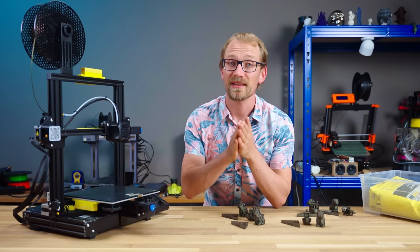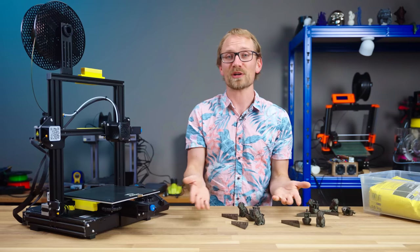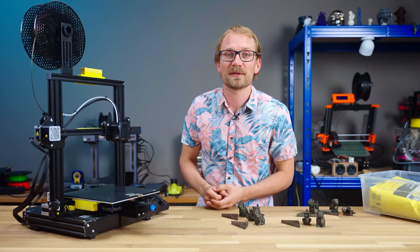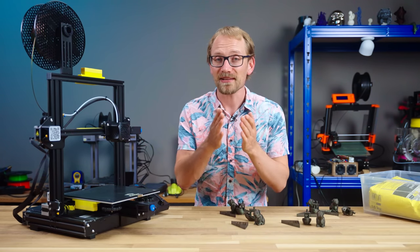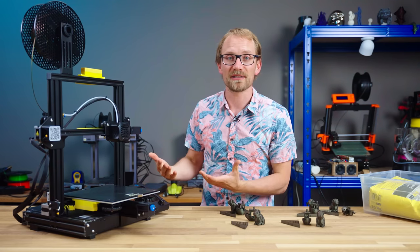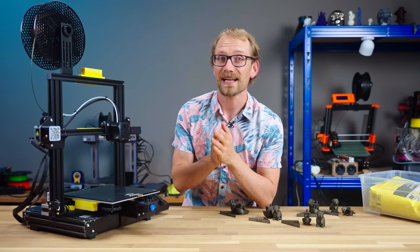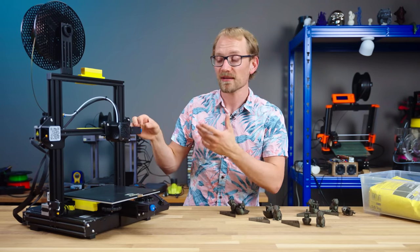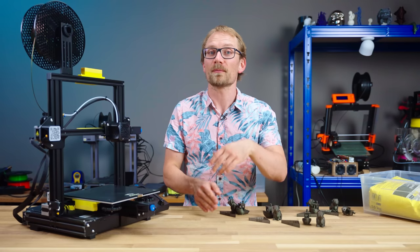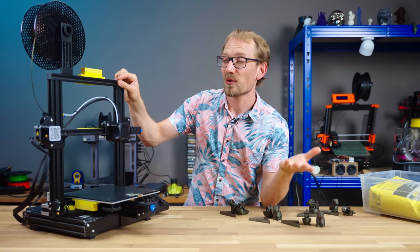Disappointed! Look, there's a real temptation here for me to just tweak accelerations a bit on some of these setups and say, hey, look, this worked super well. On YouTube, that would be a fantastic way to get easy views, because nobody can really check whether I cheated on any of these setups — but that's just not my style. I think it's really important to show the things that didn't work, so that you all won't need to waste your time trying the same things again. The fact that the anti-vibration feet worked so well in the last video was probably a lucky accident, where all the frequencies at the combination of the printer weight, the springiness of the feet and the dampening effects lined up perfectly to where we had resonances.